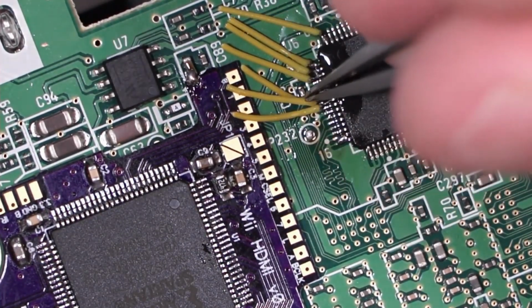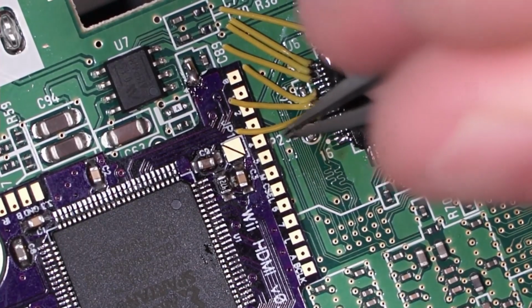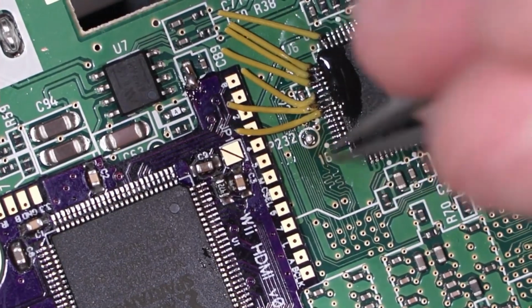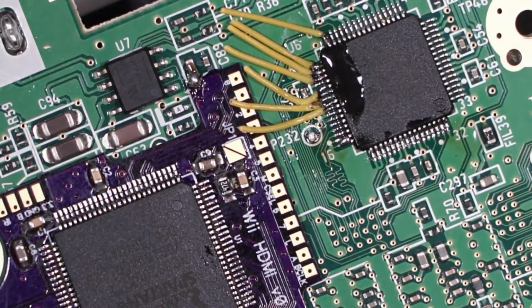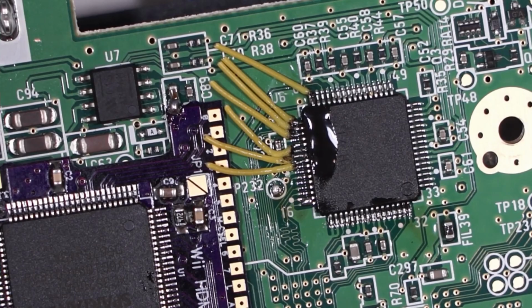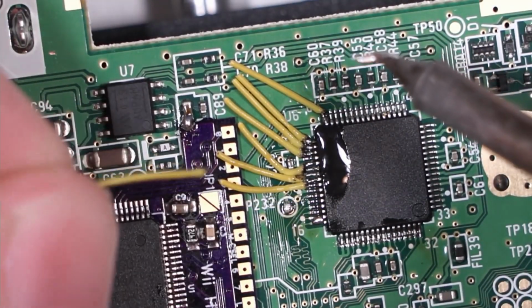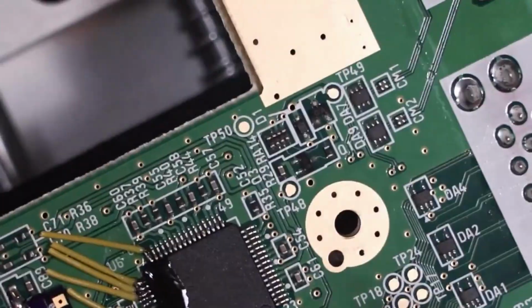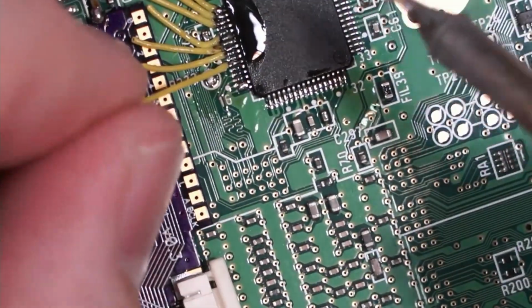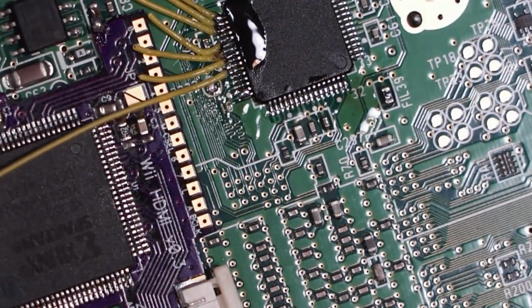You know, M, which is 54 megahertz, it's the clock signal here. You can also get it from this pad here, so if you don't want to solder to that little pin there, you really don't have to. I just did it because I'm a champion. I did it because it's hard mode. No real reason. There you go.